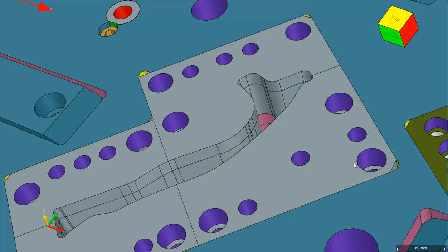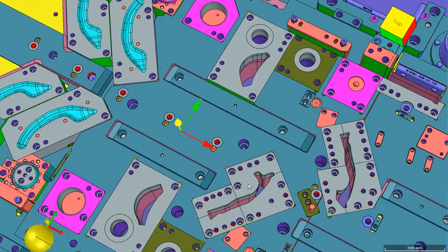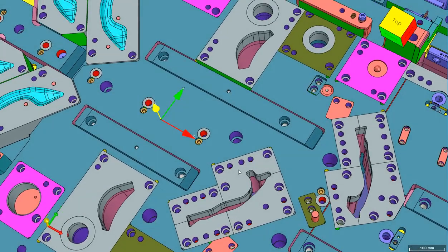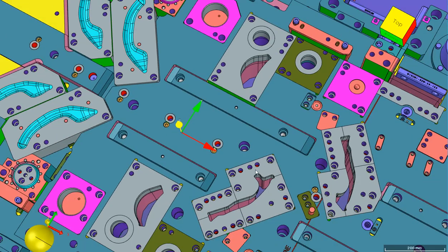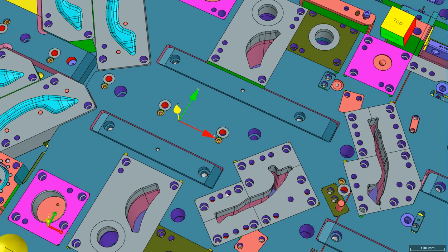This is a big plate so we have given three guide pins on three corners. The guide pins are press-fitted in the lifter plate, and the guide bushes are in the lower plate. As shown earlier, we always provide a clamp for the lifter pin and the lifter bush — the lifter pins are press-fitted in the lifter plate and we also use a guide pin clamp so the pin won't fall down.